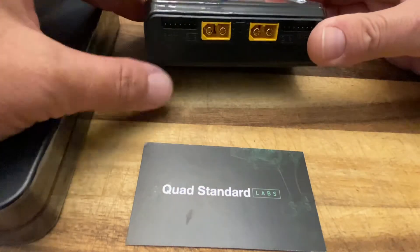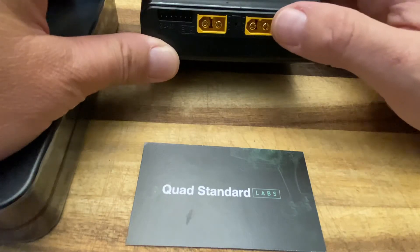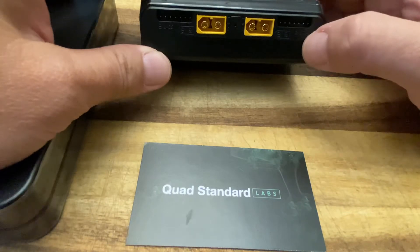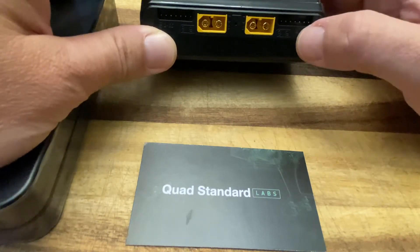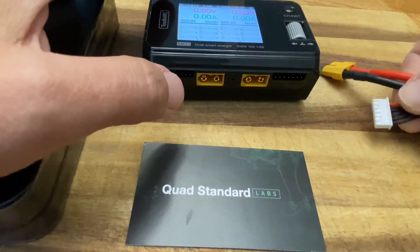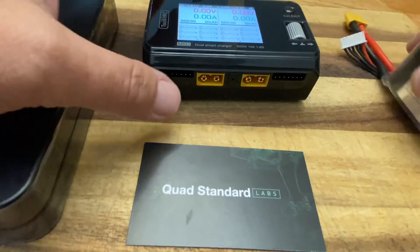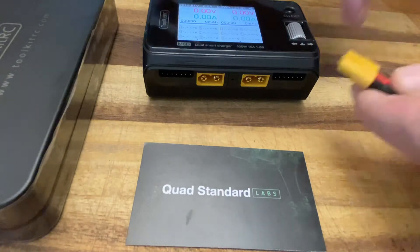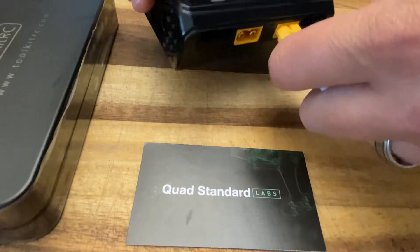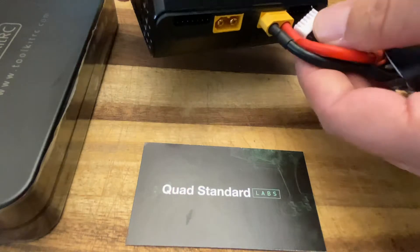On the front of the machine, you have two XT60s as well as two balance plugs. The balance plugs start on the left on both of them — cell one through cell six. They're closer to the bottom, which means they align with the pins flat down — tabs down and flat side up. When you're going to plug your battery in, you're going to first have the charger powered on, make sure it goes in the right direction, and connect that balance lead underneath.